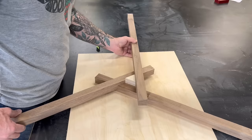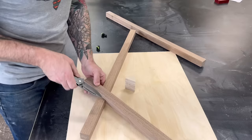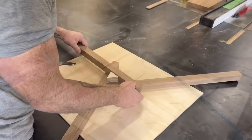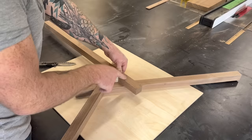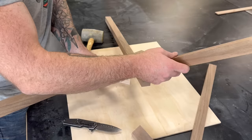I very carefully ran my pieces through my dado saw, carving out a channel at the right angle, then carried each piece over to my triangular tower template to make sure the other stretcher fit into the freshly cut half-lap and maintained the angle. Now this looks cool but it doesn't look like a stool yet — this is just the stretcher piece connecting the three legs. After I got one half-lap cut, I kept working through all the angles: going to the table saw, cutting another half-lap, making sure they fit together and still followed the right angles around the triangle. I also realized I wanted them woven together — one underneath, one over the top, alternating — creating an interlocked pattern.